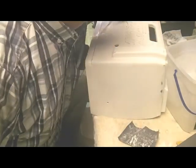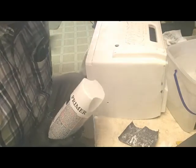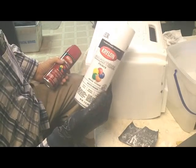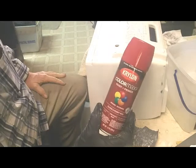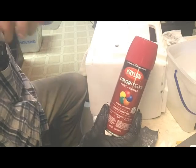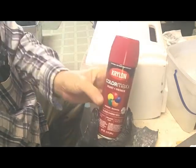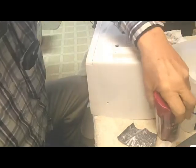Normally I would do these Bakelite radios with my regular automotive type spray gun and use automotive paint, but this time I'm trying to simplify my life, so I bought some Krylon primer, Krylon color, and this is gloss cherry red. And I sprayed some on that other cabinet that hasn't been stripped yet, and when it dries you can't tell it from the original color, so I think it's a good choice for these Coca Cola radios. And I even bought the clear to match.